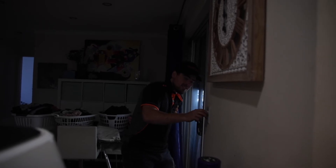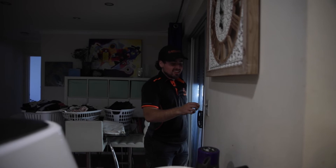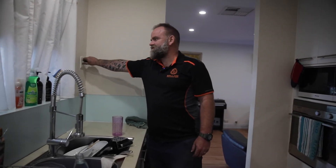So we just turned the power and lights on - we're at about the halfway point. We've pretty much covered that first section of the roof, and now just one of the light circuits is tripping when we use the roller blind controls. We're trying to work out what's going on there before we move any further, just in case any other faults arise. We like to stop at about a halfway point to make sure everything's working correctly, so if not we can fix it straight away before we move on too far and get completely lost. Looks like two blinds are working, but this one won't stop - it's got a limit on it.